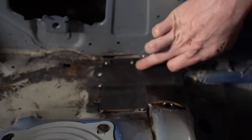We've already squared up the back of the tube. This is where squaring up the back is even more critical, because we need to change the rotation of the tube after each bend to follow the contours of the chassis. So our first rotational degree is 8, and we need to bend it at an angle of 22 degrees. So bend at 22, rotate clockwise to 8 degrees.